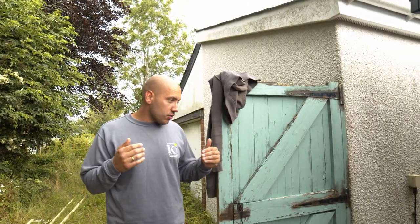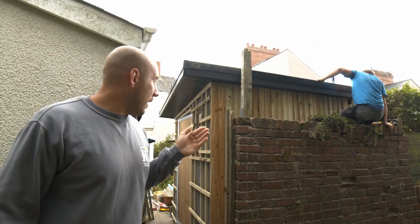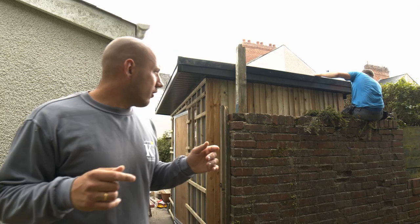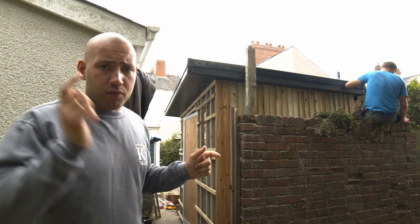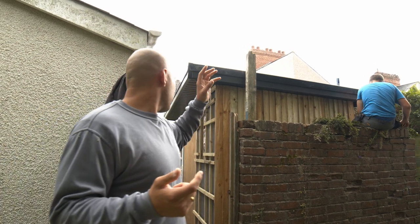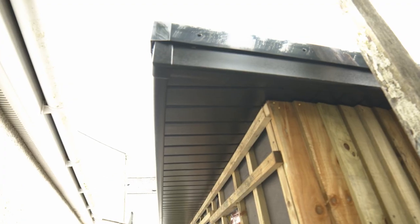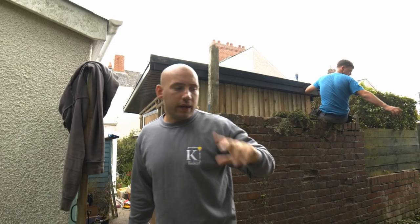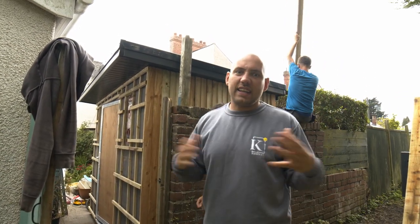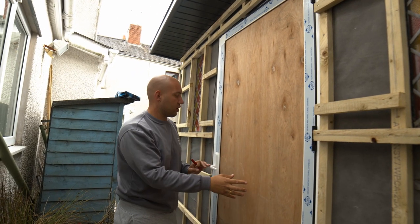As I mentioned, the garden's really tight so it's going to be hard to get really good footage. We've barely got enough room to fit in there — we have to choose which member of staff goes in. What we're basically doing: we've got a full normal garden room built, with a black ash soffit and fascia, and a rubber roof on top. For those who don't know, it's basically a giant piece of rubber that you glue down, wrap it over, and it can never leak.